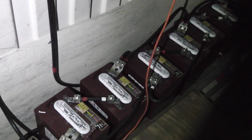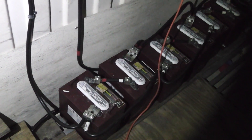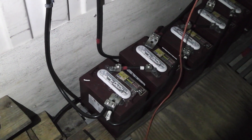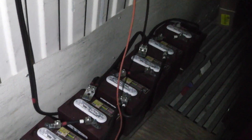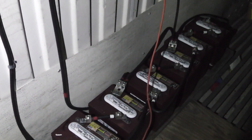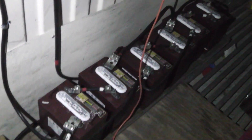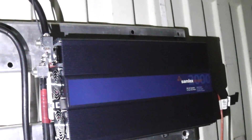I have a 2000-watt inverter, and four-ought cable that comes down to my batteries. I opted for a 12-volt system because the batteries are inexpensive. Those are golf cart batteries — 225 amp-hour, six-volt batteries. I've put two batteries in series making three sets of 12 volts, and then those are in parallel. The reason I went with a 12-volt system is I have the capacity here to charge up the battery on my tractor. I could have gone with a 48-volt setup, but if one, two, or three batteries go bad I won't have 48 volts to run a 48-volt inverter.